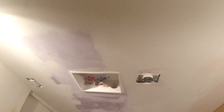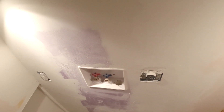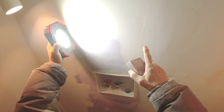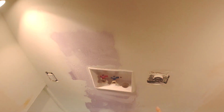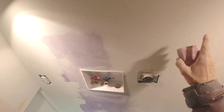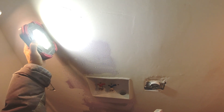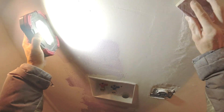In order to check your work and make sure you don't have any rough edges, take a flashlight and hold it against the wall like this. The light will cast shadows wherever you have rough edges. Without the flashlight it looks like a smooth wall, but with the flashlight on there you realize you've got a lot of sanding left to do. There's also a hump here you want to sand down a little bit.